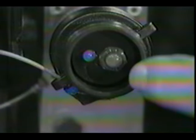Press the diagnostic tool switch for 1 second, then release. The LED should blink once, then go out. Press the switch again after the lamp goes out, and again release after 1 second. The LED should again blink once, then go off. If no faults exist, the LED will flash 2, 3, 4, or 5 times to indicate system configuration. After the configuration code, the LED comes on for 2.5 seconds and then goes off.